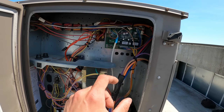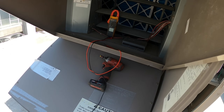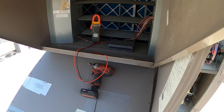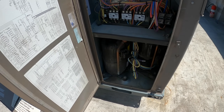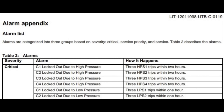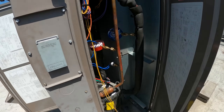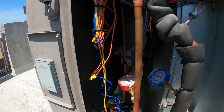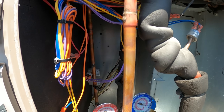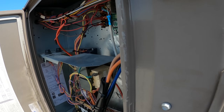The system is still cooling — we're almost at room temperature. I read in the manual that you can erase faults through this joystick menu. Communication failure — that wire or harness might be bad. The economizer also looks rusty and corroded. After an hour or two this thing is going to lock out again due to low pressure on circuit two. What I'm thinking is I'll jump out the low pressure control for circuit two. Even if the contactor pulls in, that's fine because I've got the compressor disconnected.